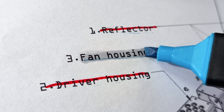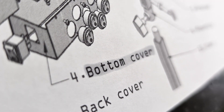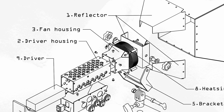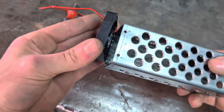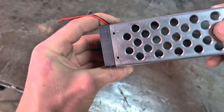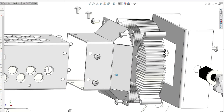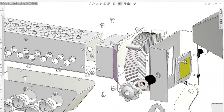Now it's time to move on to the next components from the drawings: the fan housing and the bottom cover. The fan housing will serve as the ventilation core of the entire softbox. It will house a compact cooling fan that ensures stable thermal performance for the LED matrix during extended use. The design allows for efficient airflow around the heatsink, while keeping the unit compact and rigid.